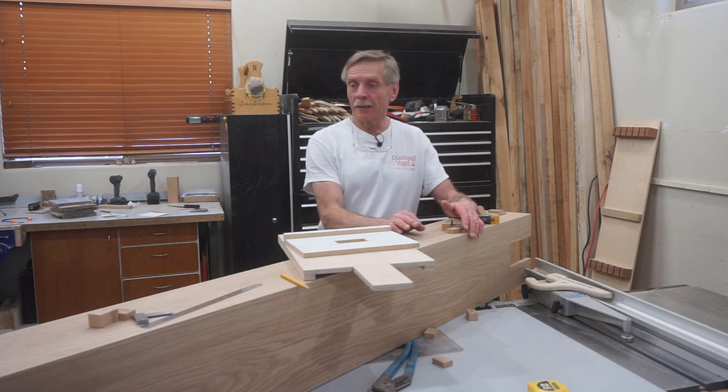On this beam the fixture is a little too tight, and on this one — which is just slightly narrower — it's a little bit loose. On this beam I'll shim it so it's snug and centered, and on this beam I'll plane a whisker off each side so that the fixture fits snug. That small variation is not an issue at all considering the size and quantity of these beams.